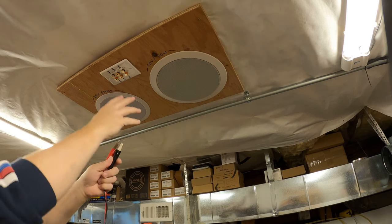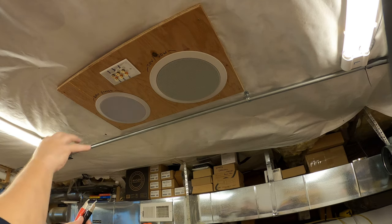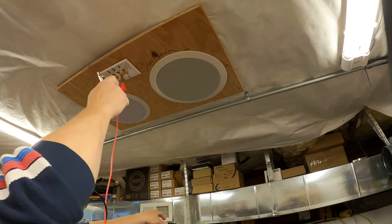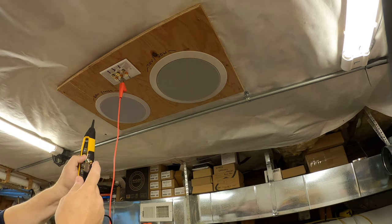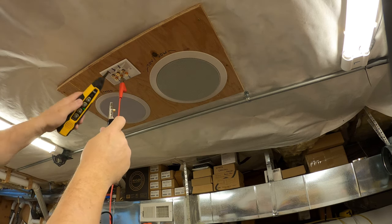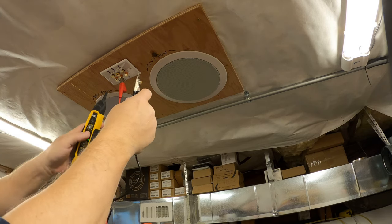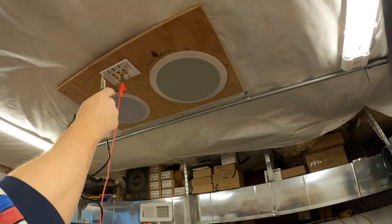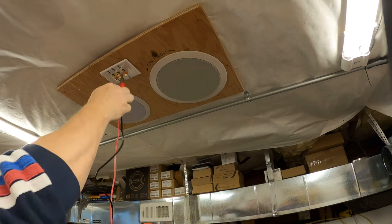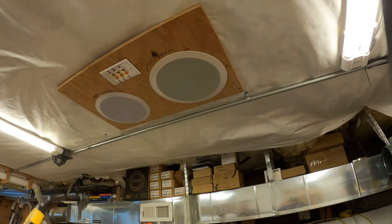Say you had some wires hanging out and you didn't hear a tone — maybe they had a pair of bookshelf speakers or some other jack that wasn't working. You could plug these in and then take your wand, turn the wand on, and trace that speaker wire to get that same tone. You don't actually have to have a speaker. It's kind of a dual-purpose tool. You can also use this to trace Cat5, phone lines, and coax lines — as long as the leads don't touch together, it'll send a tone down the wire.